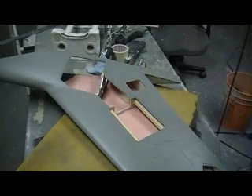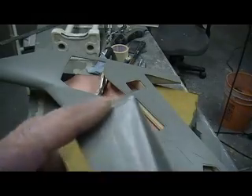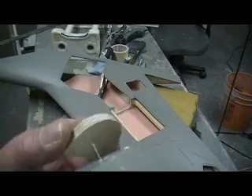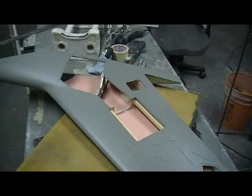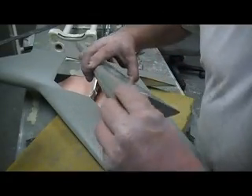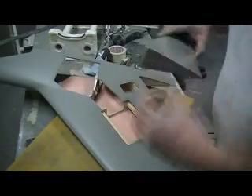A couple of things here. I'm going to go with a pen — just a little tiny one to kind of get started — to make sure my holes line up before I go drilling the big one. I took me a block of wood, put it on here and traced it, a piece of wood that fit on there. Then I took a compass, found the center, made me a hole, and marked it there.